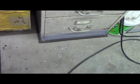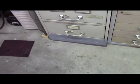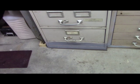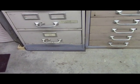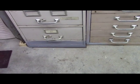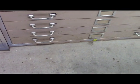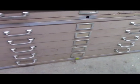So much so that, look, when I set my cabinets on the floor, you can see the tar paper under that cabinet. Concrete is so cold it condenses the moisture out of the atmosphere, and then it gets stuck underneath your cabinet. But if you put on tar paper, it ain't going to do that. It protects the steel. I don't think I got these on tar paper. I think this is on perforated pegboard or something I had. But just don't put metal cabinets on concrete.